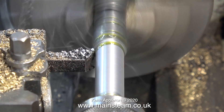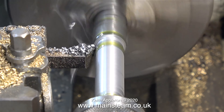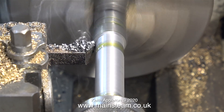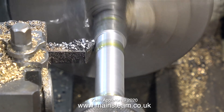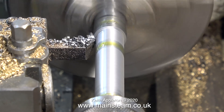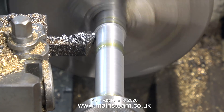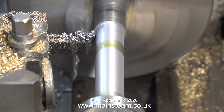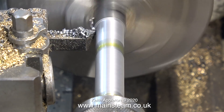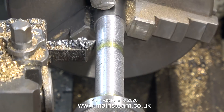These front wheels are just over 25 inches apart. Both Bob and myself took one wheel each, and we put them on the ground. When we set them to be 25 inches apart like the front wheels and measured the axle in between - guess what? The distance between the axles was 18 inches. But as you will see later on in this video, I need to make two 1-inch discs that slide onto the axle and can be welded in place. So an 18-inch space between the axles, minus the 2 inches for the discs, is once again 16 inches.